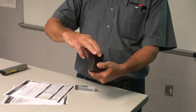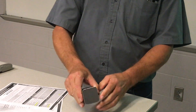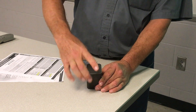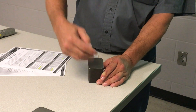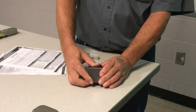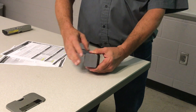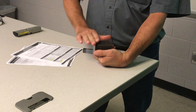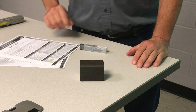Here is what our stock looks like — 4140, two by two with a quarter-inch radius on each side. As we make this part we're going to divide the overall thickness in two, taking about five-sixteenths off of each side to leave our part in the middle. Because of these rounded shapes we'll take about a quarter of an inch off, then flip it over and do the rest of the work to rough in the steps.